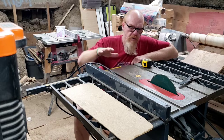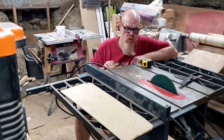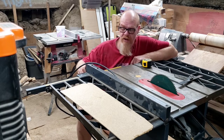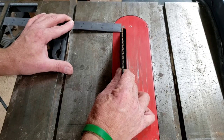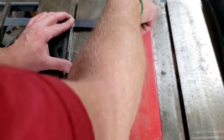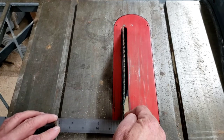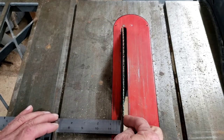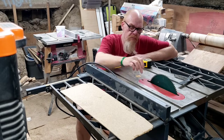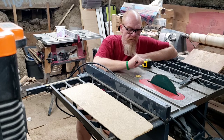I've got it reassembled and I've got the fence adjusted so it's just over the tabletop. I had to adjust the rails and the cam lock was super super tight, so I adjusted that. I've raised the blade all the way up and made sure that my blade and my trunnion are parallel to my miter slots — that is right on. I also had to adjust my insert because it was sticking up in the back side; there are four allen set screws right here that needed to be adjusted, and I've got that fixed up.